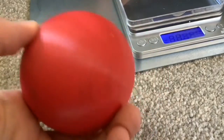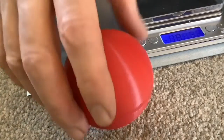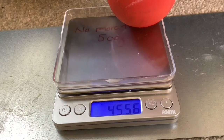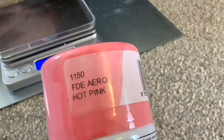There was another problem with the red ball in that the marks of the 3D printing caused a kind of sheen, and that seemed to confuse the eyeballs — a lot of the time they didn't seem to be able to line up with it correctly to kick it. So the last ball Paul made he covered with some enamel spray paint, and this does seem to have worked to get rid of that sheen.